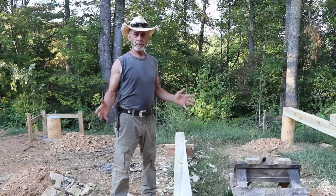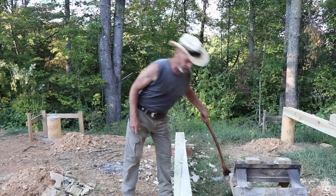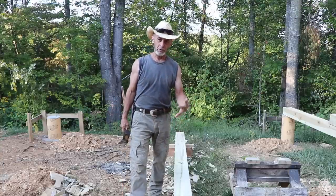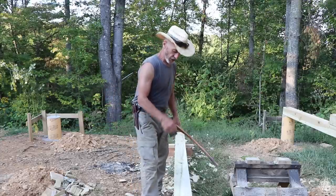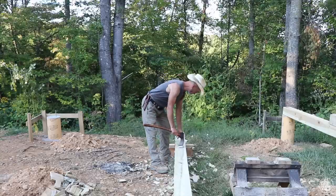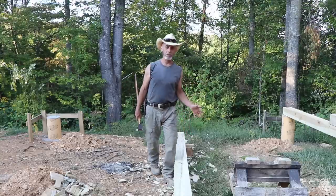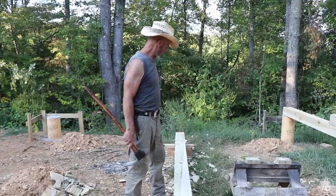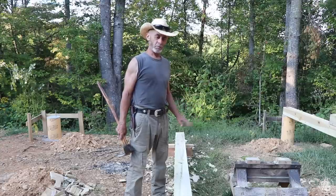Well, I guess you can tell I'm kind of going for the distressed look. This foot adds right here, it basically looks like it's been hewn out. So the only section that I did, though, I stayed 6 inches away from any joint, which up here ends up being a foot, and then 6 inches at the top because I got the braces right there. I want them to meet nice and flush. So it'll give it a little bit of a design, and I think make it look good. And then also we're going to burn it and put the timber frame oil on it.